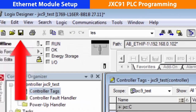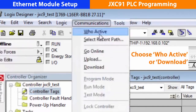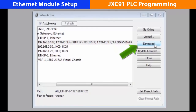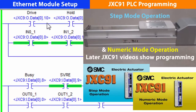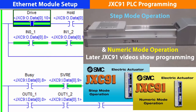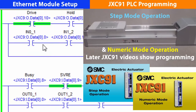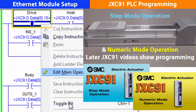Now save each like this into the program. Then run WHO Active from the communications tab. Finally, download the application into the PLC. Let's now drive it to two different positions. Choose the position to go to — in this case 3 — toggle the drive bit on, and the actuator goes there. Going to position 0, do the same but toggle the drive bit off first, then on, and watch it move over to 0.